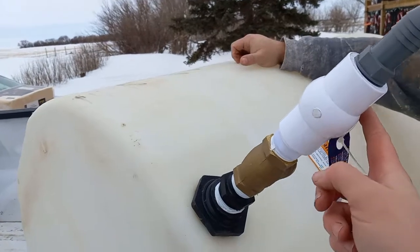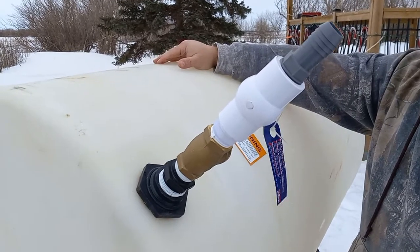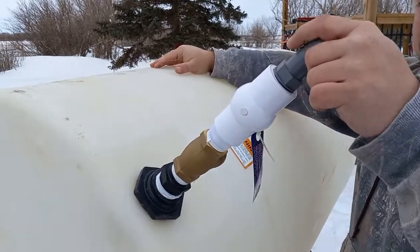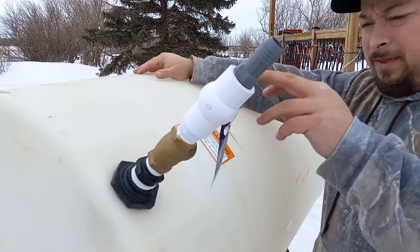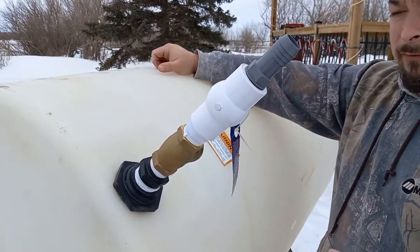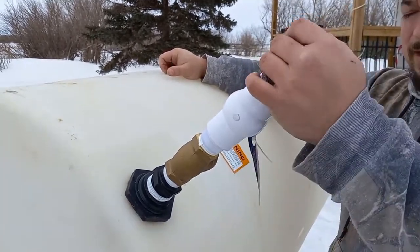And the ball valve is, again, just another check to make sure that if there's something wrong, there's no water freely flowing. If something happens with the hose, the barb fails, you can turn it off and you're not draining all your water into the basement. So that's all that is. And our existing system had a ball valve coming up out of the floor from the cistern, but it was basically rusted out and seized, so we couldn't even turn that water off at any time.